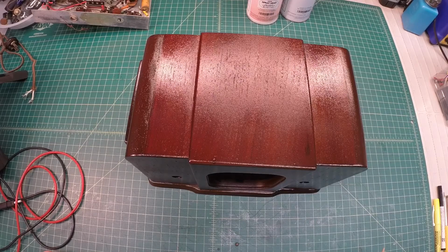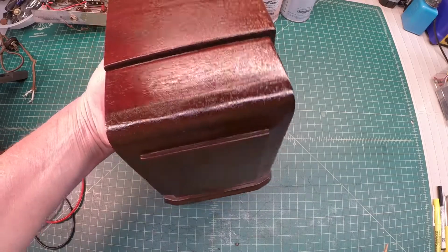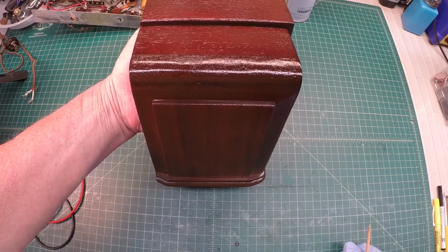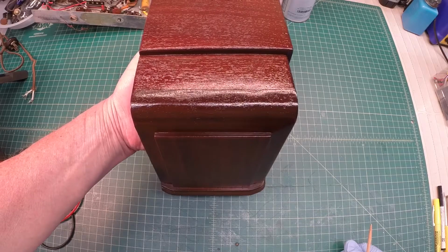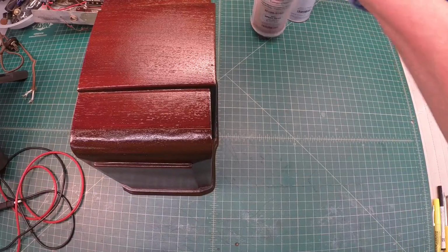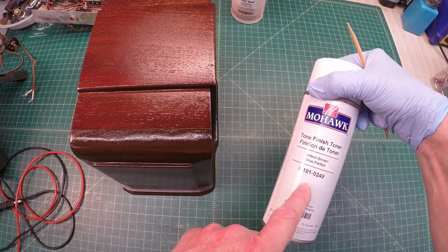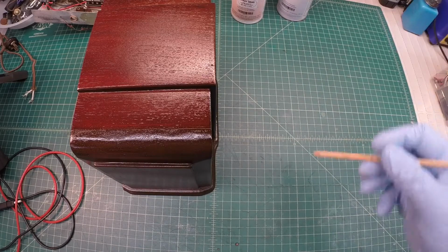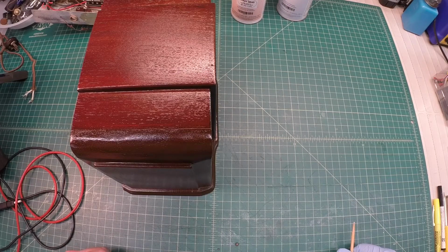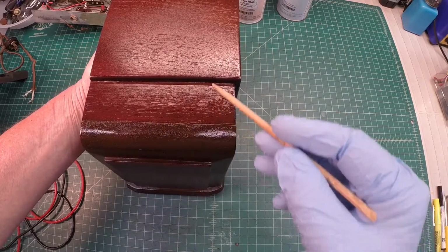Okay, here we have it. I made quick work out of that. Took about, I don't know, 2 or 3 minutes. Anyway, you can see what we've got here. And again, I've hit it with some high gloss. I'm going to knock this way down more to a matte finish when we're done. But the reason I use the clear lacquer after using the toners, I used just a little bit of the pigment-based Perfect Brown, just a little misty right in this area, to kind of melt the toners together. So those areas, I tried to blend together here.